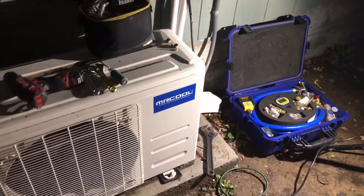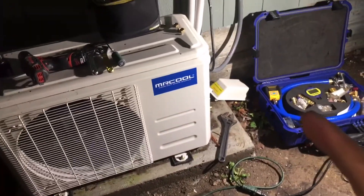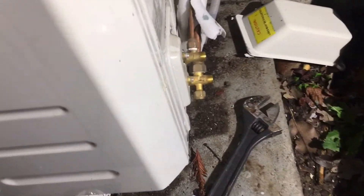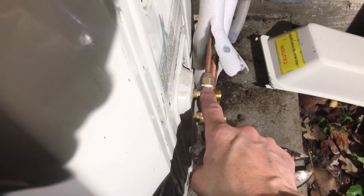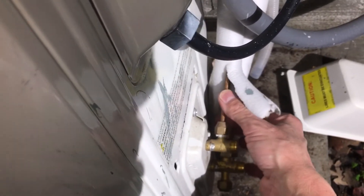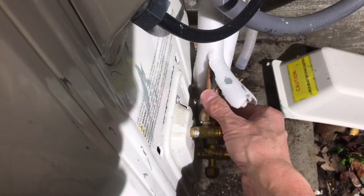They said it wouldn't run, it makes noise. I turned it on — it makes noise, it blows inside. A general contractor did this and used water plumbing tape to try to seal the system. When I tried to run it and put my fingers on the lines, the temperature was cool on both — about 59 degrees on both sides — and there's vibration from the motor inside.